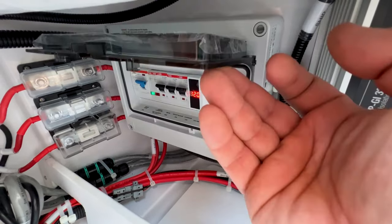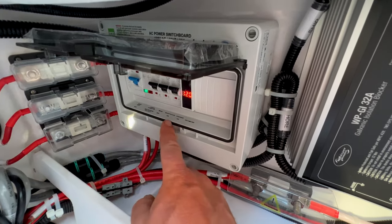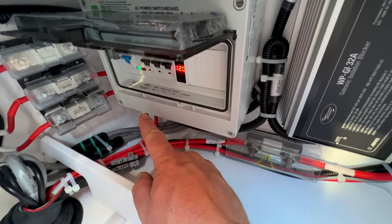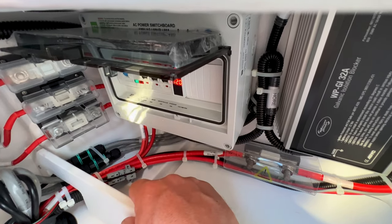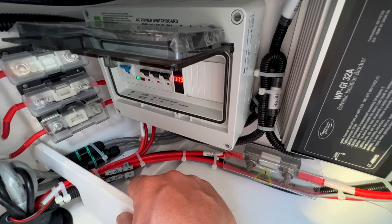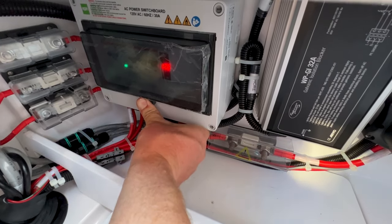Open the AC switch panel and you'll see 120 volts indicated — that means shore power is connected. There's a row of AC breakers clearly labeled: the first is the charger, then receptacles, then main, plus a reverse polarity light. There's also an RCD — a residual current device, similar to a GFCI. If there's a difference between neutral and ground it'll trip that breaker, meaning electricity is going somewhere it shouldn't. The panel is quite a firm press-and-pull to open and close — that's normal.